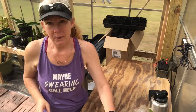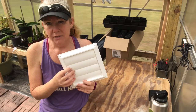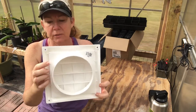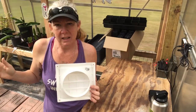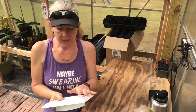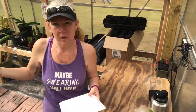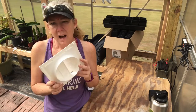The next component is the vents for the opposite side of the greenhouse — a 6-inch plastic dryer vent. You can see it has a 6-inch opening and it is louvered. With a 1,000 CFM fan on the opposite end, it will create enough of a pull to open these louvers. I'm only installing one to begin with to see how the fan pulls, and if it needs another vent, I'll add the second one.